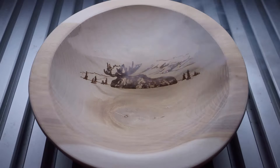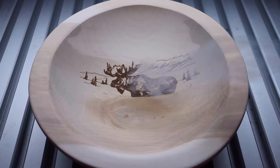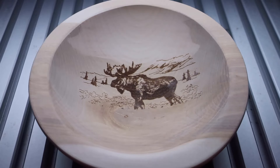We used a 60-watt SpeedMarker CL laser system to test this application. Before we started testing, we knew that the standard 200mm lens would not achieve the marking field size and focus depth requirements we needed for this application. We switched to the 300mm lens because it has a larger marking field size and better depth of focus than the 200mm lens, with a 25% larger spot size.